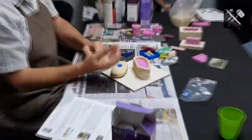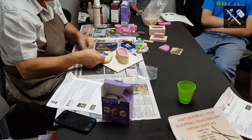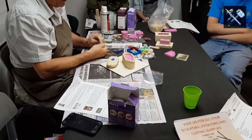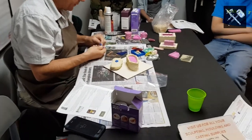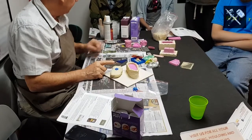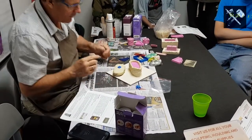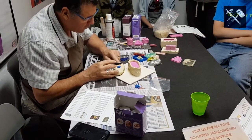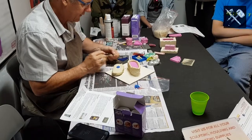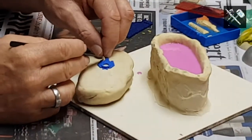So then when you pull it off, turn your part over. If you've got a gap under there, when you turn it over, the silicone will have run in underneath, and we don't want that happening, because on our second pour we want to pick up all this intricate detail, all those little holes. So in the case of this little sculpting tool, there's lots of different types, and all you would do then is you would just work the clay up. If there is a little gap, you can just get some little bits of clay off with your tool, just work it into those little gaps there,